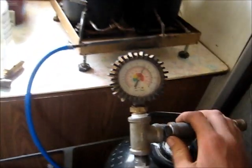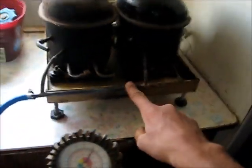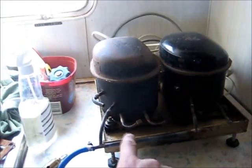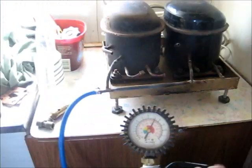Calibrate the pop valve to 120 psi. I'll go a tiny bit more so it allows it to seal shut at that pressure. If it goes past that pressure, it'll start to open, but it won't go past that pressure. The only thing I don't have is a low pressure cut-off like these switches have, so I'm a bit snookered for low pressure head pressure dumping. But I'll open the valve, charge the tank, shut it off, and bring the tank out in the field to pump tires and stuff up. I'll have a high pressure valve in there for extra safety, so it cuts off at the right pressure.